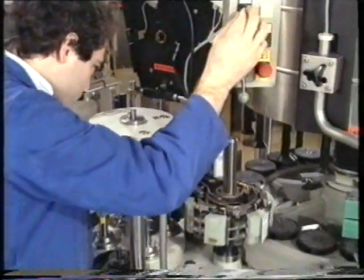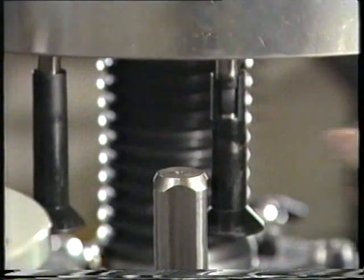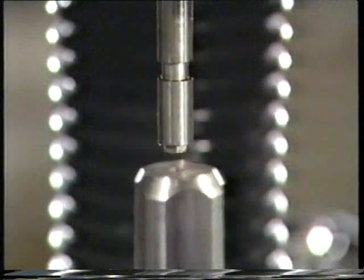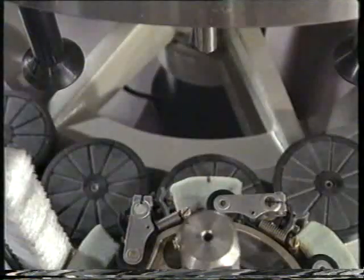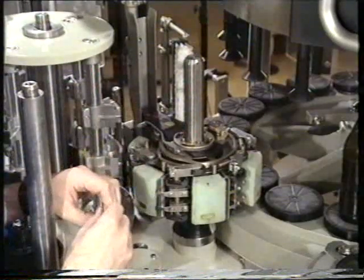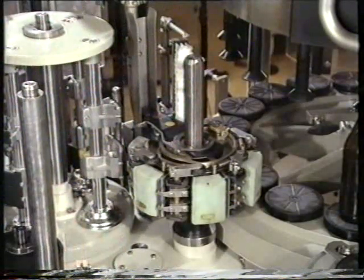In order to transfer the center of the label to the center of the bottle, the machine is inched to the transfer axis. The gripper shaft must line up with the centering bell and the main column of the machine. The mark on the sponge should now lie exactly on this line.